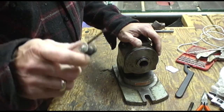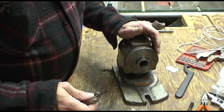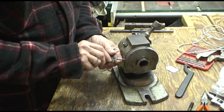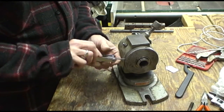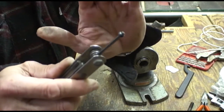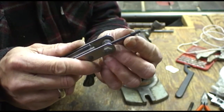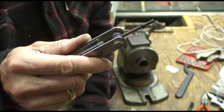What you have to assume is that there's a locking set screw. Now what is that? There are actually locking set screws that are sold. I'll show you what a locking set screw looks like. See this little tiny set screw? It passes right over the Allen wrench — there's no bottom to it. That's a locking set screw.